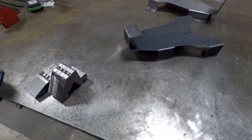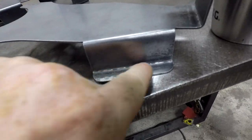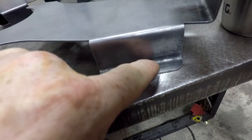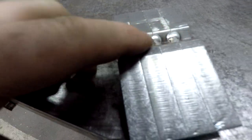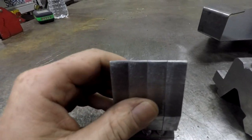I wasted a bunch of time today on these dies, because what was happening, as you can see here, the Swag Offroad dies, they don't line up. Even when you bolt them in, they don't line up right. You're supposed to weld them. So what I did was I welded it here, and it's hard to keep these straight. They're laser cut, and half inch on the laser cutter is always pretty sketchy.